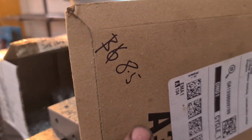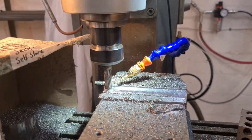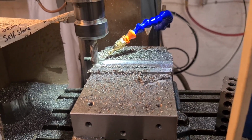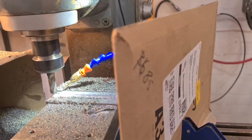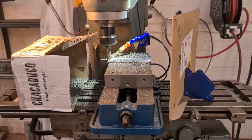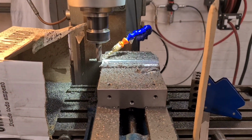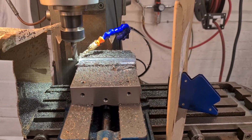So I'm now at 8.5mm, because it leaves a 0.5 of a millimetre skim. Although I'm using a roughing cutter, I don't want to go straight to the full 9. I think it's more accurate to give yourself a finishing cut. That way, I've not got to remember it, so I can get on and do other things while the old milling machine's running away and the stops are doing their magic. Set a cut, get it moving, wait for it to click off, come back, rinse, repeat.